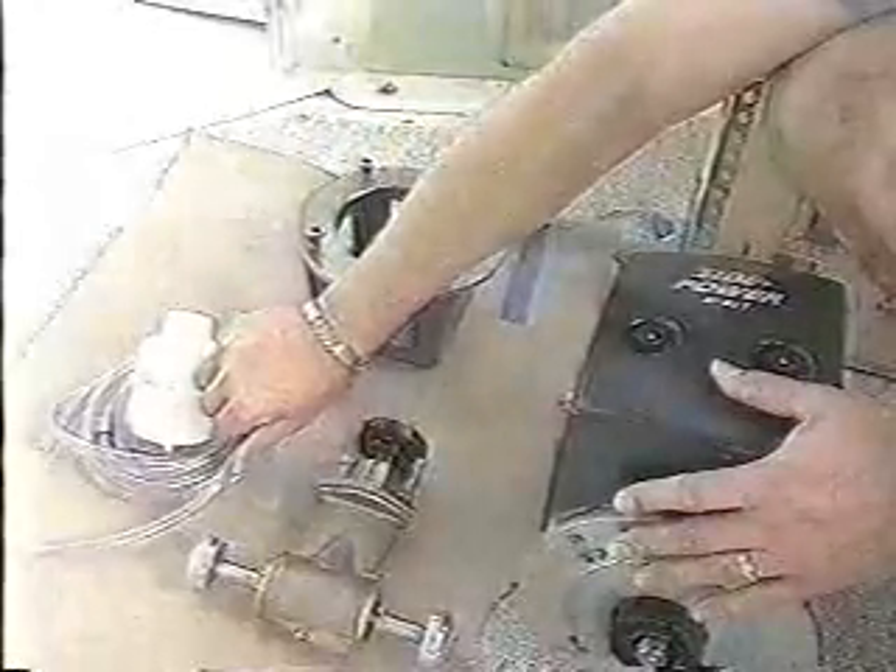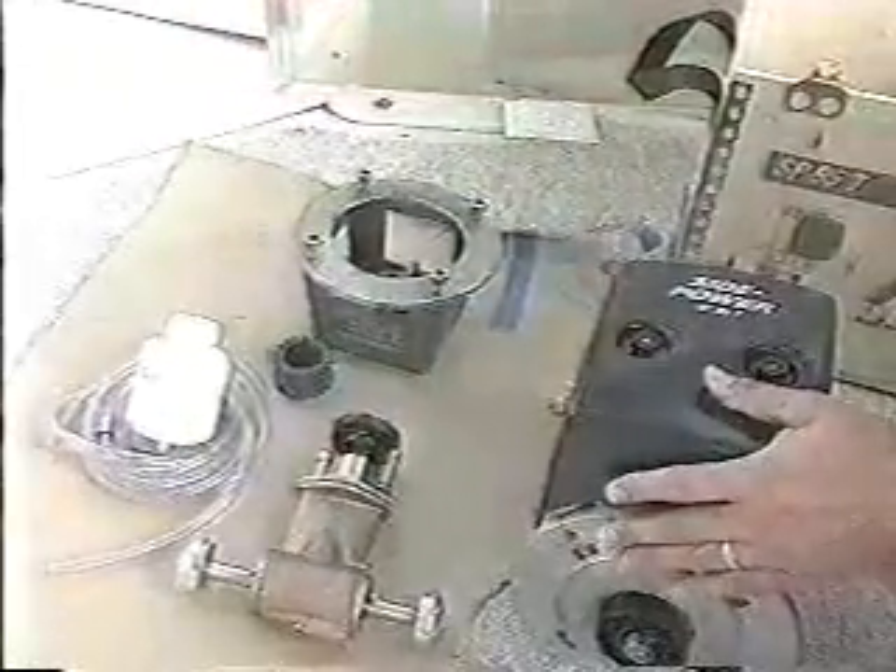We'll make that with our mounting bracket. To that we are then going to fit our electric motor. We also mount our oil bottle and our hose, which basically allows our oil pressure to our gear leg to offset the water pressure outside. Once that's in place, all we're doing is hooking up our battery cables, our negative and our positive cables to the motor. We're going to connect that to our battery disconnect and plug in our harness, which is all a plug-and-play system. Everything just plugs right in and you're good to go. We're going to turn on our battery switch and then power up the system and everything should be live. And that's basically the installation — very simple once the unit's in place.